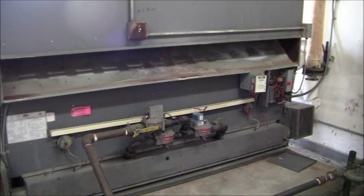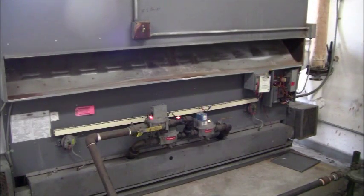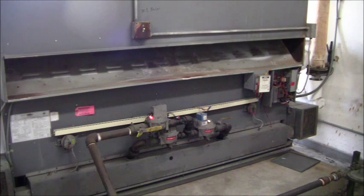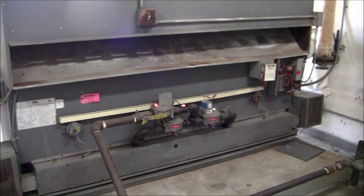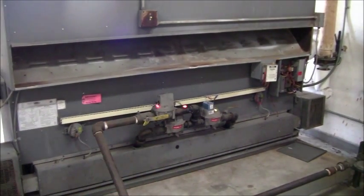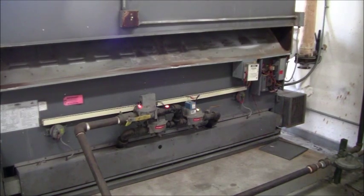The boiler is going through another startup sequence. After it starts up, we'll go ahead and test the left-hand side. You can see the lights are on — I'm going to pull out this one here. It just took out that one natural gas valve. That one apparently just does the left-hand side, but it did work. So apparently that proving switch is just for the left-hand side. The other one over there will take the whole boiler down. Those are those two safety devices.